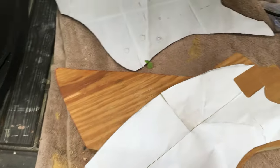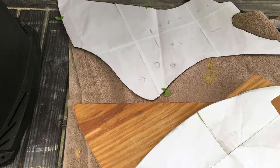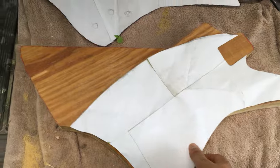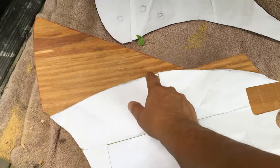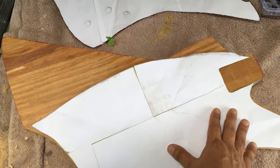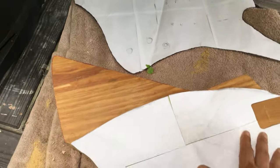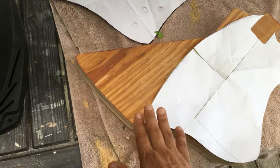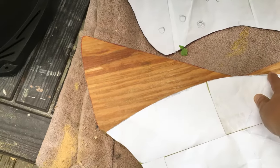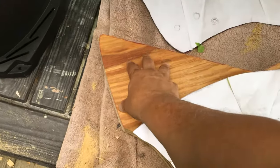So this is the second cutout of this guitar, and this is going to be really cool. Now, I don't know if you noticed on my first Serpent Sting, this layer was recessed. So it looked really killer. I'm going to do the same thing, but on this one the recess is going to be more predominant. Instead of being a gradual recess, I'm going to cut this piece probably like a quarter inch, and there's going to be a quarter inch void like that.